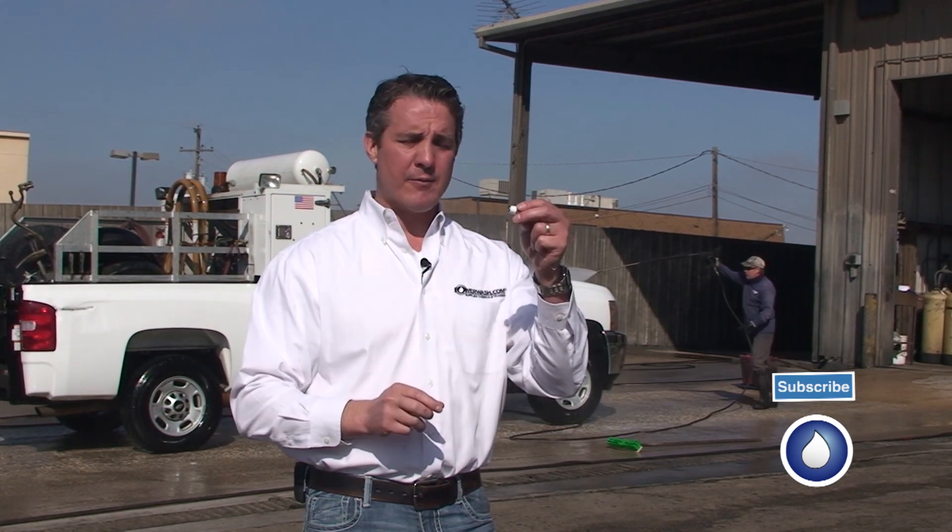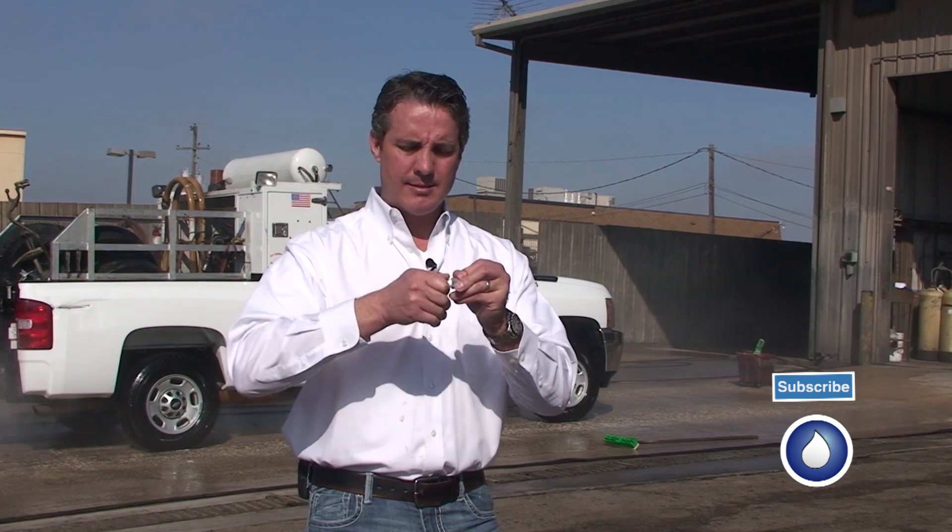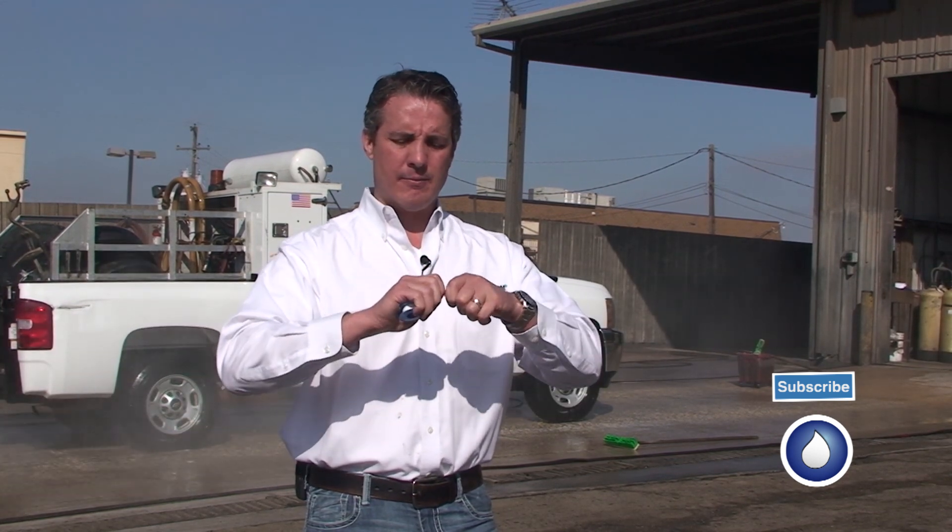And this doesn't just have to be right here — that could be anywhere through the power wash as I wrap threads so they're sealed. The other thing about when I wrapped that way: I was wrapping with the threads, so when I go to put it together, the tape tightens as I put it together and it's not going to unroll or untighten.